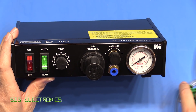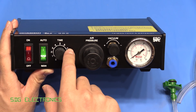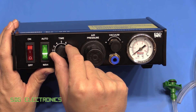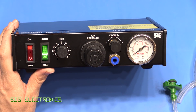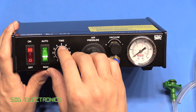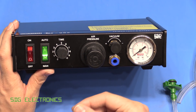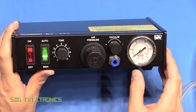There are various different models — I think this is the most basic. There are a few other variants, the 982A and B, and some of them have a digital timer where you can set the time more precisely. When set to automatic mode you set a preset number that you've found works well, and every time you press the foot pedal it dispenses air for exactly the same amount of time. That time depends on the viscosity of the fluid and the air pressure, but once set up you can put exactly the same amount of solder paste on each pad for a really consistent result.